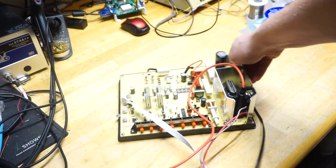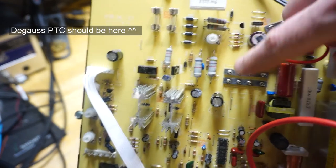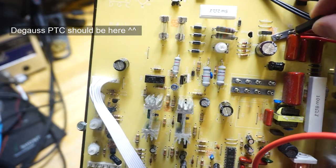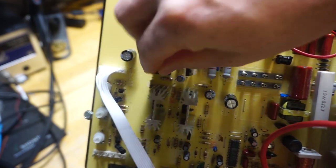It's apparently a clone of a Wei Ya design that was sold in the 2000s. The PCB design has been whittled down to save costs over the years. These days you are unlikely to find the degaussing thermistor or pin header, and in some cases you'll even be missing the high and low vertical resistance switch, robbing you of much of its universality.